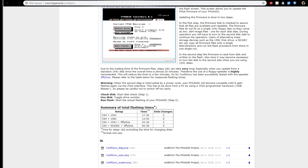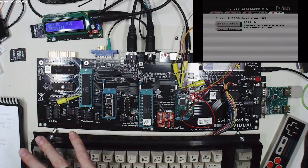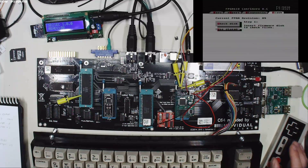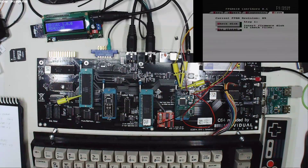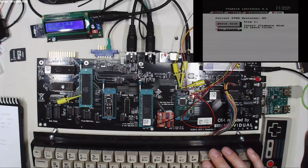That's the main reason I'm using my SD2IEC device for this project. Since the appearance of the Pi1541 I kind of abandoned the SD2IEC device, but it still has a lot of benefits. One major benefit is that it works very well in conjunction with JiffyDOS. I have JiffyDOS installed on this Reloaded MK1 board — hence this custom EEPROM — and the SD2IEC device utilizes the JiffyDOS fast loader. I'm on firmware version 1.0.0 of the SD2IEC, which is almost the latest version available.